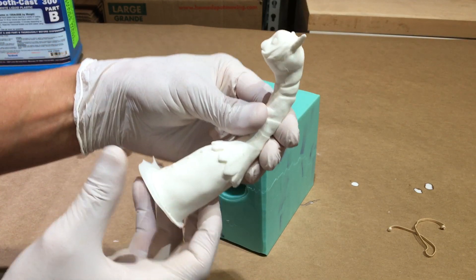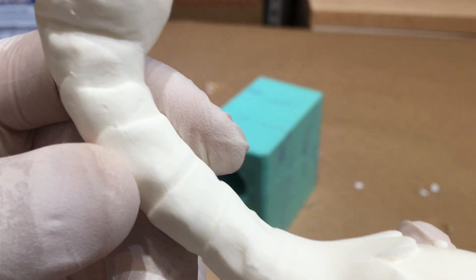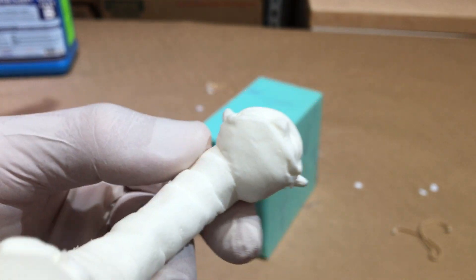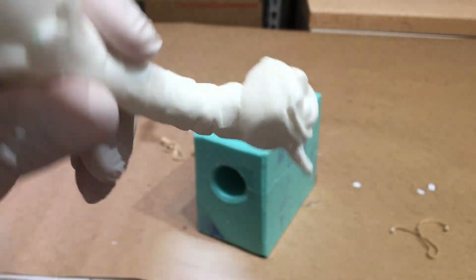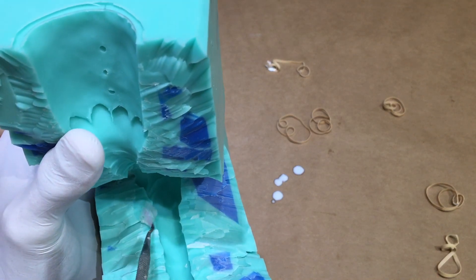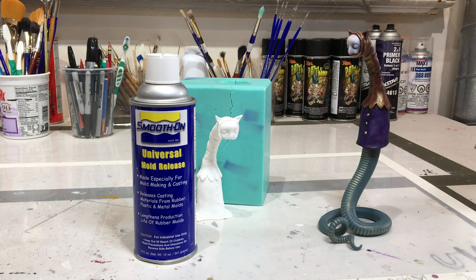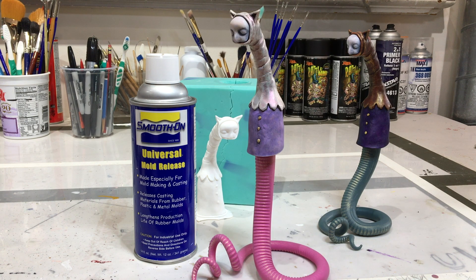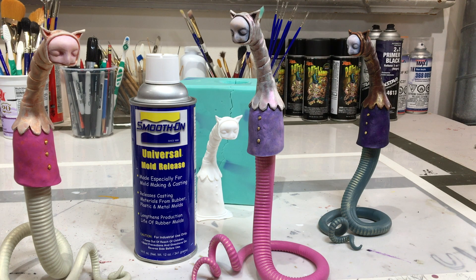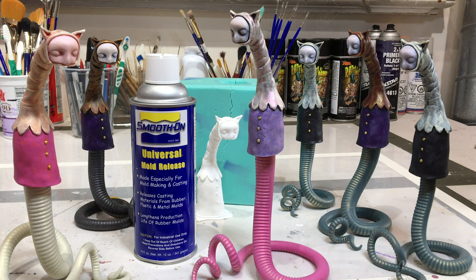Here's the piece out of the mold. You can see there's a tiny bit of flashing to clean up on both sides where the seam was, but this is not a big deal — probably cleanable in a couple of minutes. No bubbles got trapped or formed underneath the neck, so I would say this is a successful casting. Sometimes you'll find thin little pieces of flashing left over along the cut marks. I'll lightly scrape these out with a dental tool and brush it off with a cotton rag before I pour the next one. I used to use Smooth-On's universal mold release instead of baby powder and it worked great, but with the spray I always had to wash the resins with soap and water prior to painting. With the baby powder no washing is needed — I just go straight to painting. The baby powder made the whole process more efficient by eliminating that step.